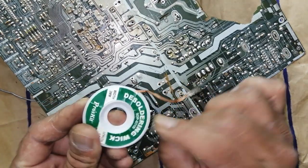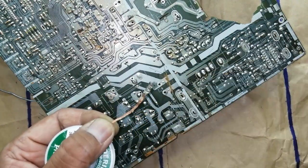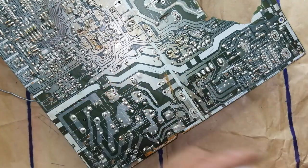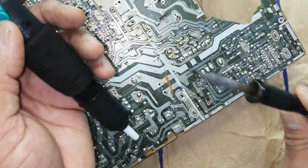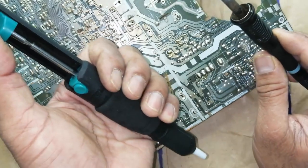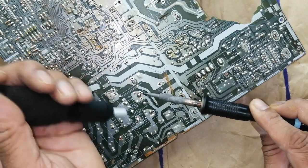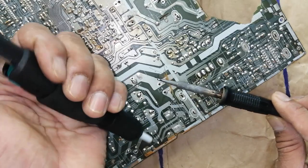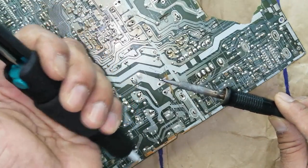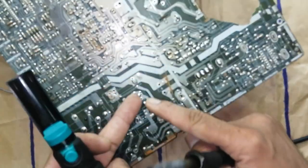Before this, I have uploaded a video on how to de-solder using de-soldering wick, where I discussed how to remove a component using a soldering iron. In another video, I discussed how to remove a component using a de-soldering pump or de-soldering sucker and soldering iron — you heat up the solder point, press the manual sucker, and it sucks the liquid solder into its chamber, freeing the contact.